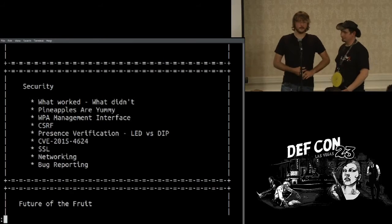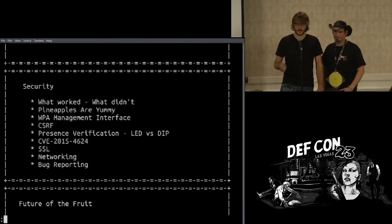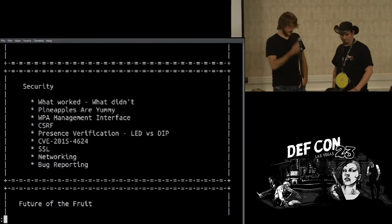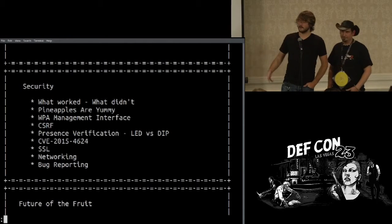And for this, if you want to skip this entire dip switch setup totally, you just add a file on the SD card that's listed in our changelog, skip dip setup, and if you have that file on there, it'll just skip that portion entirely so you can actually deploy it like that. Because if you have physical access to the device anyway, it's owned.